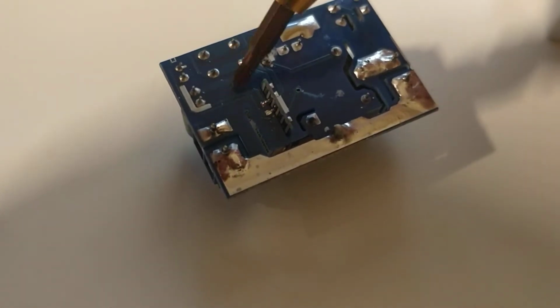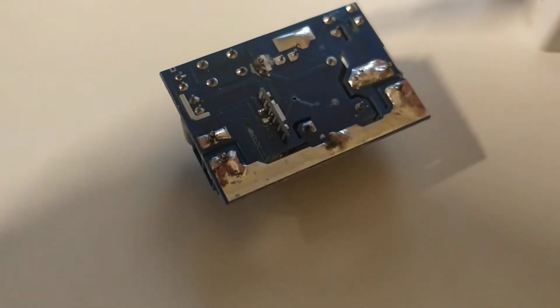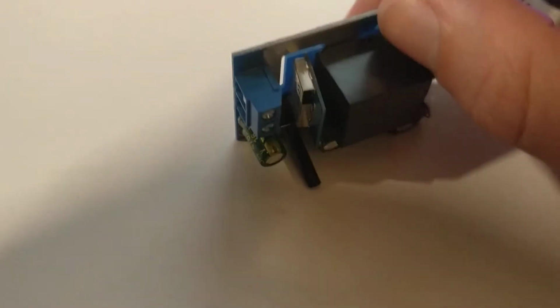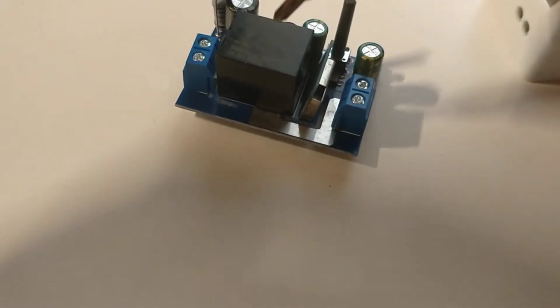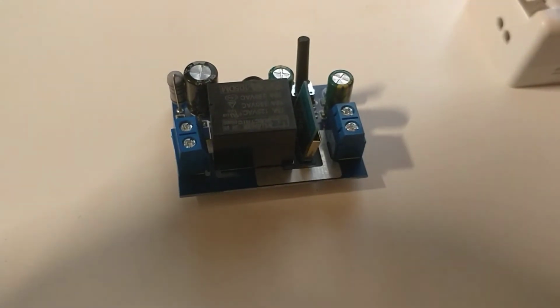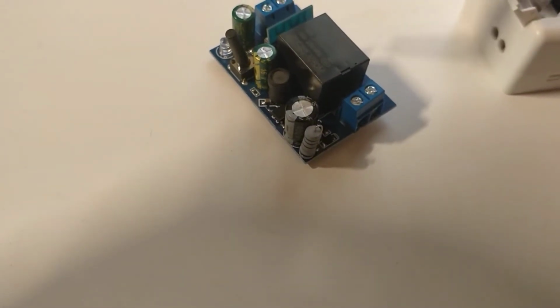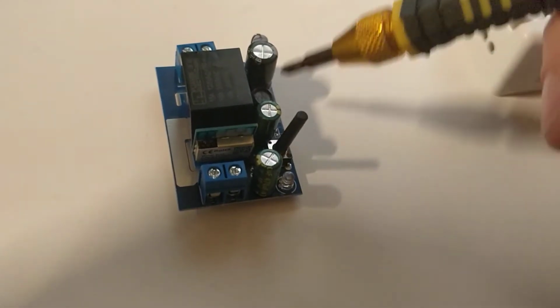And these two contacts here and here, or here and here, if you solder a switch to them, just a momentary switch, you can have control again. And that's pleasing. The isolation's pleasing as well. Interestingly, this is neutral and live is on the back of the board. As far as these switches go, yeah, simple enough. They take a little power feed off in here, and pretty much everything on here.